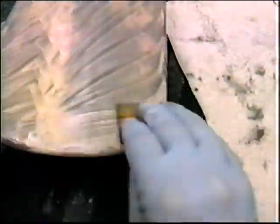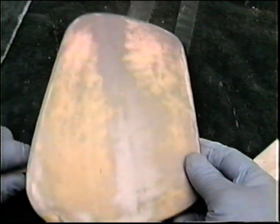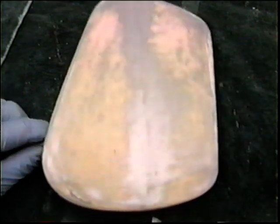I wanted to show this as a point of reference because this is one of the little things that a lot of people maybe could benefit by. Just quickly before I get another coat of silver on here. And of course the silver comes right off. That's not a problem at all. But I really want to use M600 here because I've noticed, see there's a low spot there where if a little bit of water got in there or whatever, I'd be in trouble. Now see how the silver builds it. Now what I did, I went back and forth over this four or five times. Well, kind of skim coated it in. Now when I put the next coat on here, maybe one coat or even two coats more, this should totally blend that in. So we go from having a visible seam, or a seam that we really want to bury, and this is the easiest way I know of to bury it.